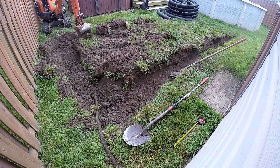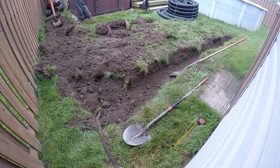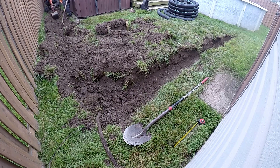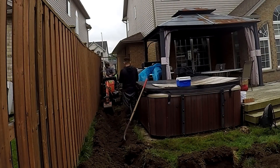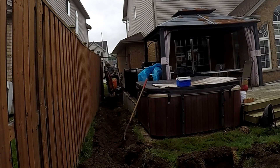The big problem we had was, once we did the back excavation through here, the tracks couldn't extend wide enough that I felt comfortable that the trench wouldn't collapse. With the excavation bucket being 12 inches, the tracks would have been right on the edge, and it was pretty sloppy enough that it would have collapsed. So I didn't feel safe enough to do that.